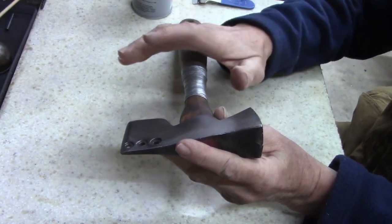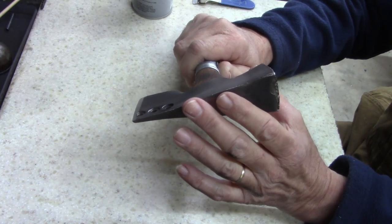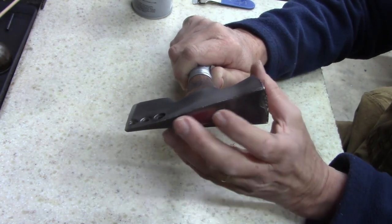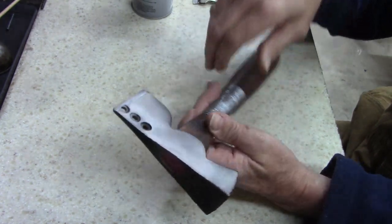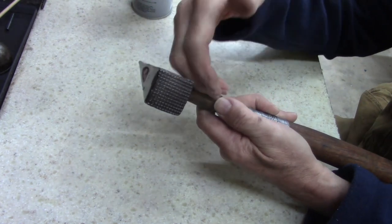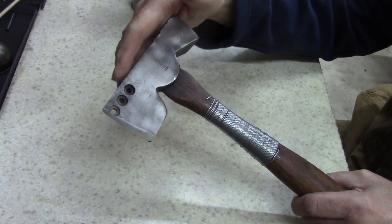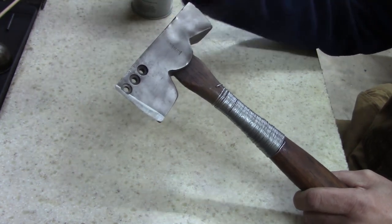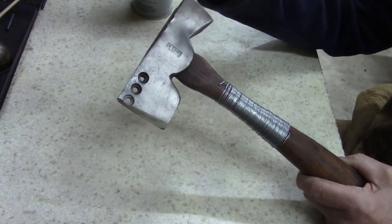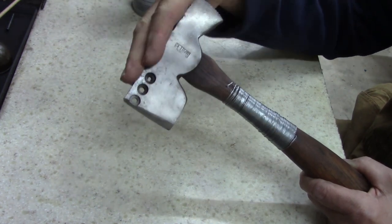I'm used to fixing hammers on the job site. That's why I don't glue the shims in my heads when I redo a hammer, because if I'm using it on a job site, you can quickly fix it and not have to drill it out and beat the head off the handle or cut that. Sometimes the head just comes loose and you need to reset it. You don't need to cut the handle off and buy a new handle, you can reuse the old handle. They work loose. That's just the way it is. And you can fix them on job sites. Now an axe, I understand why I would agree with gluing the shims in. But on a hammer, especially a hammer like that, now a large sledgehammer, yeah, I can see where you want to glue a head on, or a shim in the head.